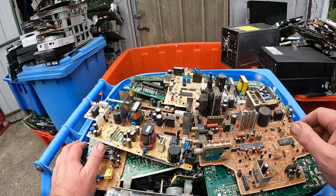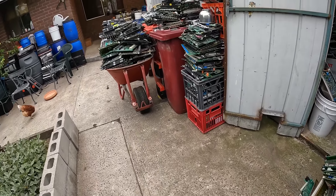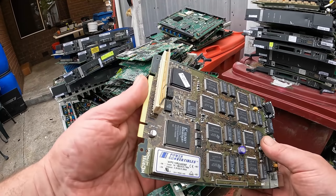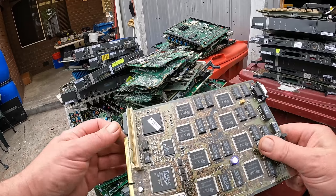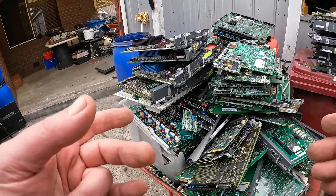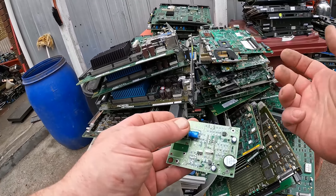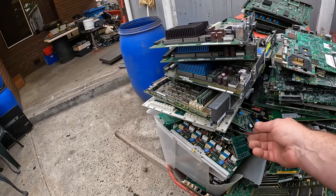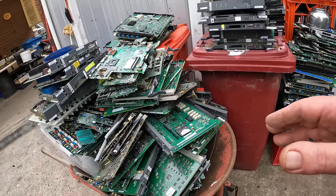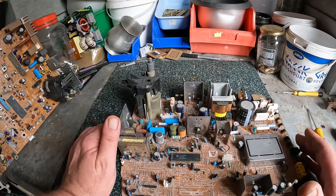As you can see, this is all high-end and some super high-end stuff. Here we've got a telecom grade board at about $6 a kilo - that's a big difference compared to $0.28. Same as your laptop motherboards - this is all for precious metal recovery. So what I'm basically buying now is boards that are mid-grade and above. Most mid-grade boards are green. Now I'll get a bunch of low-grade boards and just show you what I would depopulate from these boards.